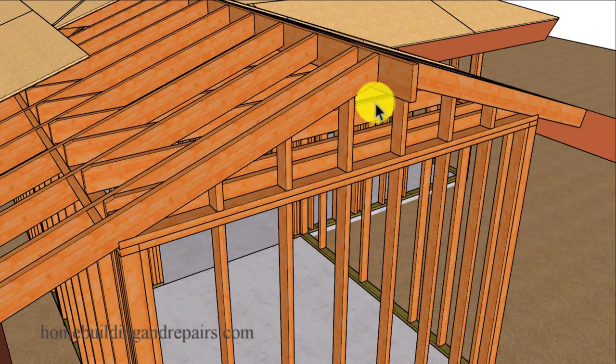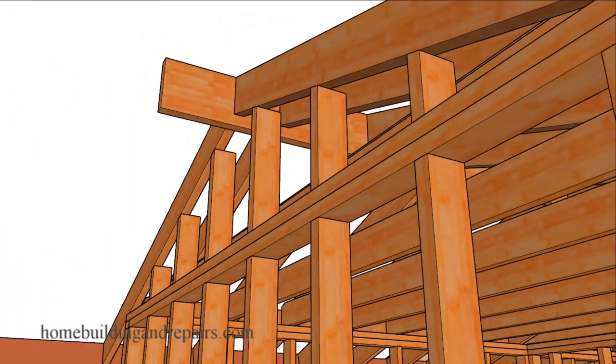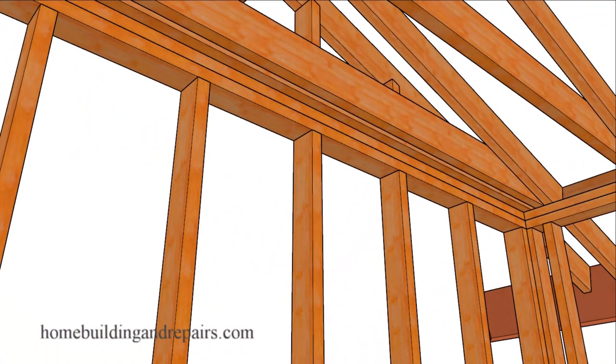Don't forget that in some cases you're going to need a gable vent or roof dormer vents to allow for attic air circulation. I'm starting to wonder if we're ever going to get rid of that — there seem to be a lot of problems created in colder climates from the moisture in the air that might freeze in your attic and then thaw out in the springtime, creating some type of water damage, along with some of the newer spray foam insulation techniques.